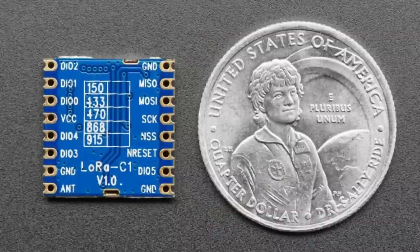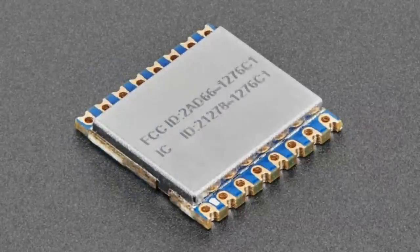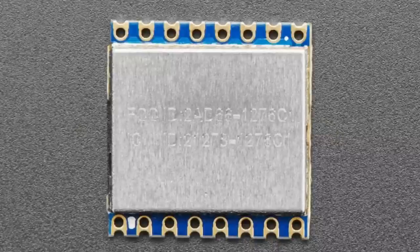And that's the ISM band. We have libraries in CircuitPython, and I think MicroPython also, and Arduino all have libraries for the SX1276 chipset inside. You connect an antenna to the antenna pin, connect power and all the signals to the other pins, and you basically have a LoRa transceiver. Now, it's a little tougher to use than our module that has level shifting, power supply, and antenna connector. But if you're designing your own board, these are hand solderable. We put them in the shop so people can design their own boards.